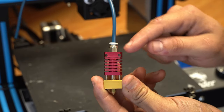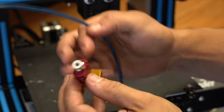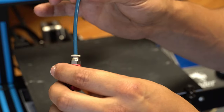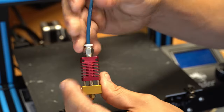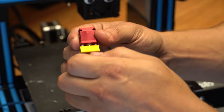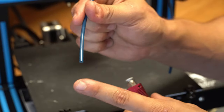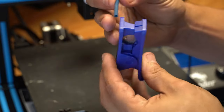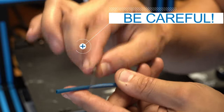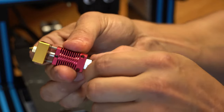This can happen because the coupler starts to fail or blow out. If your Bowden tube backs out too much, it'll destroy the teeth inside the coupler. So if you start to have a really bad clog, just replace this coupler — there are teeth in there to grip the Bowden tube and hold it in. I always suggest replacing the stock white Bowden tubes because they get smooth and knurl up more easily and will start to back out over time. If you're ever having trouble getting your Bowden tube out, heat up your hot end and unscrew the coupler — it'll slide up the tube and you can pull the entire Bowden tube out. When you install new Bowden tube, make sure it's cut nice and flush. I'll also score the outside of the Bowden tube with a razor — putting little cuts into it to give it more grip so the coupler has more to grab onto and it doesn't want to come out as easily.